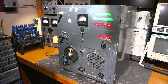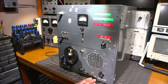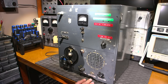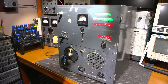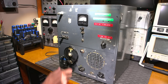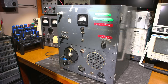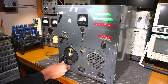On the bottom we have the receiver, which looks like a single band unit. There's a beat oscillator on the bottom — an RF gain control — and the beat oscillator would be for zero-beating the transmitter into the receiver, so you can have them synchronized. They're two completely separate units in one case. We also have a tone control, on/off, and a volume control — very simple.